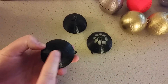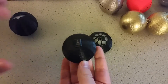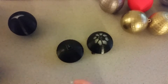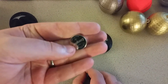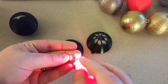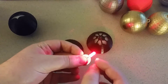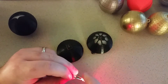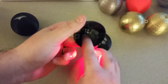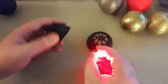Okay, so that's how the circular one works. Now this one you may have noticed actually has a switch in the back of it, which means we're going to put some electronics in it. We can pretty much put whatever we want in there, but the easiest is just to get a little LED — I have a red one here — and a coin cell battery that you normally put in watches and stuff like that. Fun fact about these: if you get the right LEDs, you can actually just slide it on like that and it will light up. I believe these are actually called LED throwies or something like that — they use them at events and stuff. And you can actually work in a resistor here to make it last longer, which is the proper way to do it. Then you can also solder to this switch in here so you can turn it on and off when you don't want it.